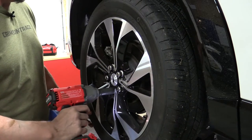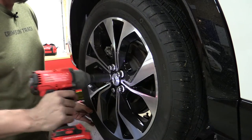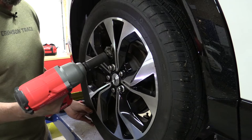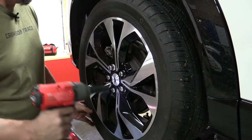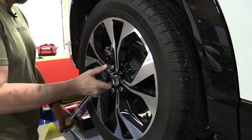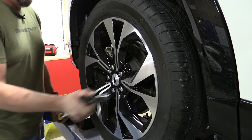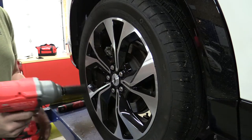We're going to go in and just slowly tighten these up on level one. That was full throttle there. So level one is really slow — it's kind of like hand tight. That surprises me. I just want to get a wrench on this and feel with my hand. That's about 10 foot-pounds — there's nothing there. So level one does not do a whole lot, which is very interesting. Let's go to level two.